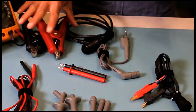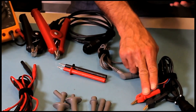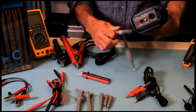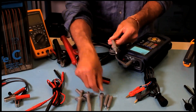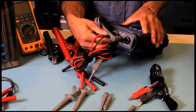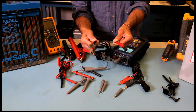I'd like to show you some of the accessories that go with the EC1000 and EC2000 that are used for both battery testing and for diagnostics on power systems. I'd like to start with the standard Kelvin connections — our standard Kelvin clips. There are also mini clips for smaller battery terminals. Not shown here are extension probes and single point Kelvin probes for testing batteries that have caps with small holes. There's an oscilloscope probe attachment that allows you to test noise and other things on UPS and power systems, and this takes a number of different accessories. We also have extensions used for voltage monitoring, temperature monitoring, and current clamps that work with the EC1000 and EC2000. There are also grounding clips and clips for getting to batteries to measure voltages.